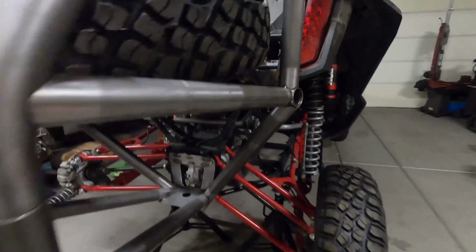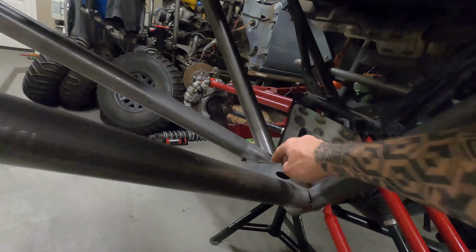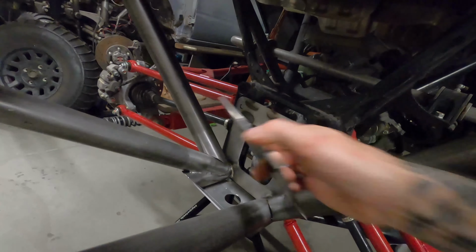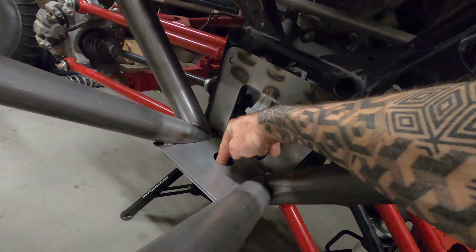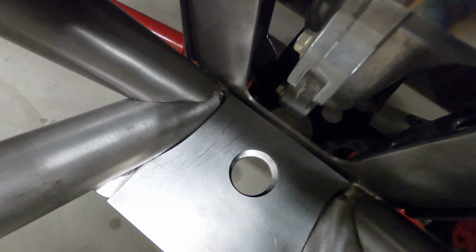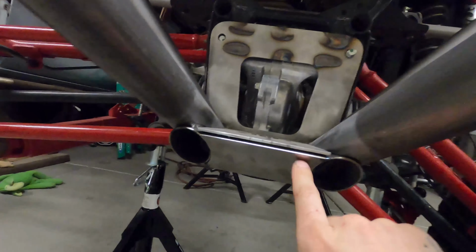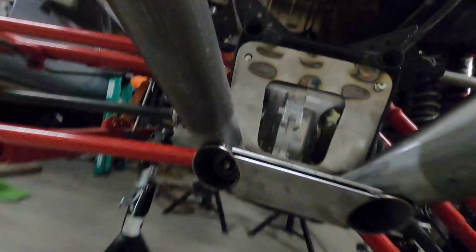And we did it, came over here, and tied these tubes all in. So this is all going to be tied in perfectly. There'll be a plate up here. We still have to finish fitting this top plate, but all those tubes are welded 100%. Then I'll lay this tube over the top, a tube that'll go straight through, which I did just because of a cosmetic thing, and I'll have that all welded. This whole rear bulkhead is going to be real nice. You can see it's all plated in real nice, and it's going to look really neat.